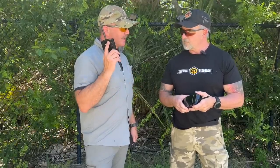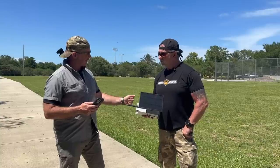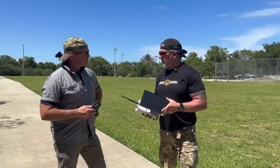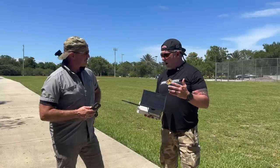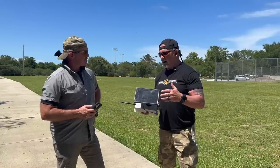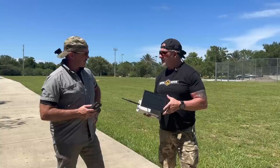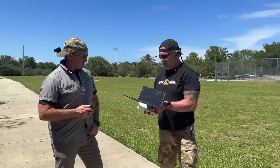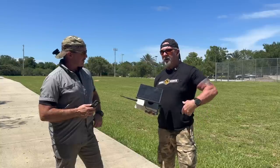Next, let's take a closer look at the repeaters. So we've got the WaveShark repeater. It has its own power source and I can see a solar panel here as well. These are $249 right now — not super expensive for what it is. With line of sight you're looking at a 10-mile range; in town with obstructions, somewhere around a couple of miles. It really depends on elevation and line of sight. They're powered by a 3,300 milliamp-hour LiPo battery with a 5-volt solar panel charging them. It's a one-and-done — you charge it initially, deploy it, and it consumes very little energy. It's IP67 rated for water resistance and is a pretty utilitarian device designed to be deployed in the great outdoors.